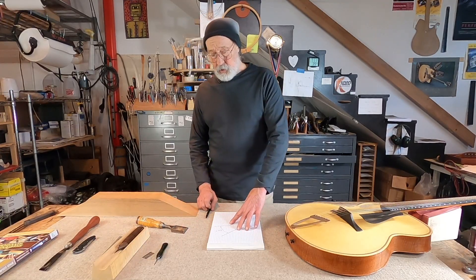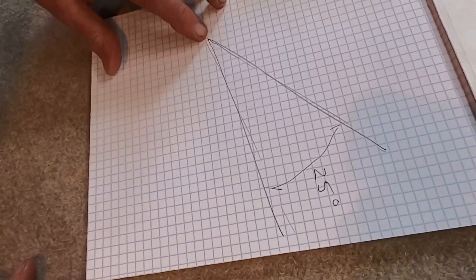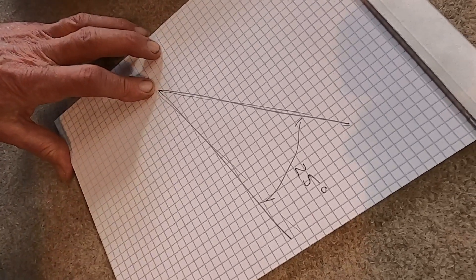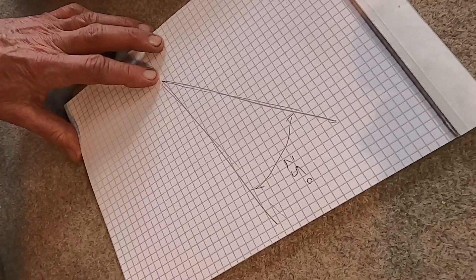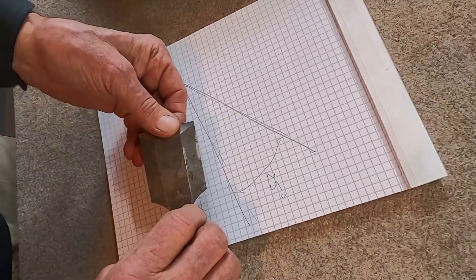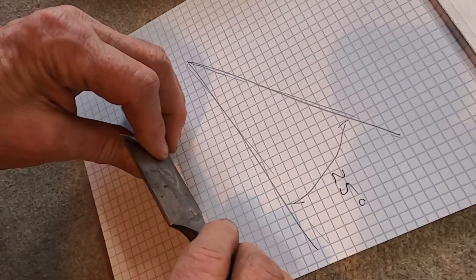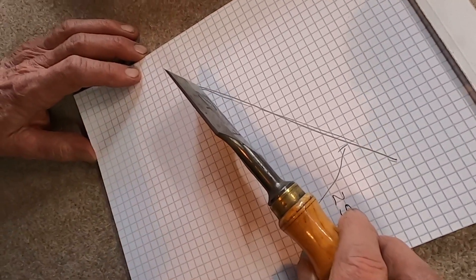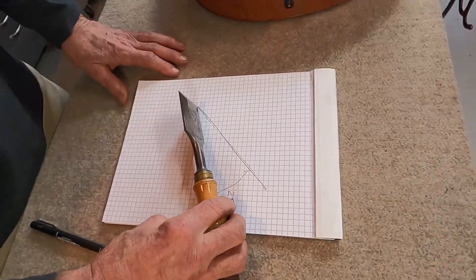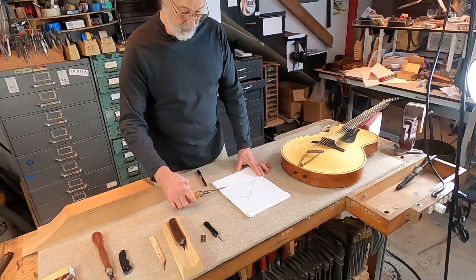The sharpness angle is determined partly by the quality of the material. In order for the tool to stay sharp, the steel that the tool is made out of has to be alloyed correctly and hardened and tempered correctly so that it will hold a fine edge. The things that contribute to the longevity of an edge are the smoothness of the edge, the material, the style of steel, the alloy of steel that we're using, and of course, the quality of the surfaces that we get when we sharpen it.